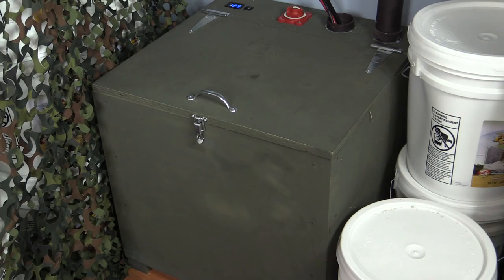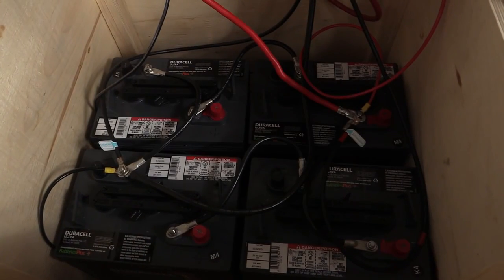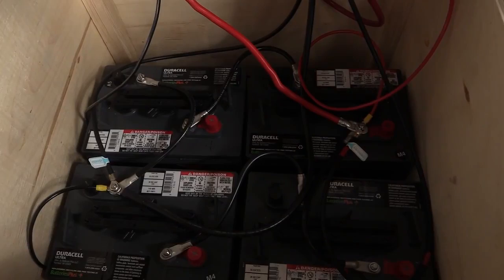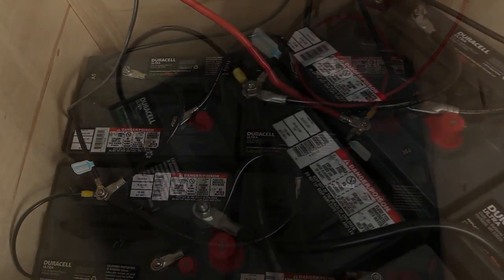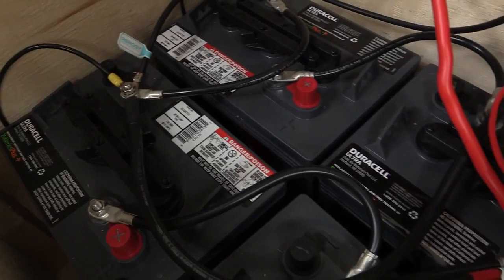The point of enclosing batteries is to avoid having all 5 kilowatt hours from discharging at once, in spectacular fashion. When working with batteries, we have lots of points of access to the power, or terminals, and we really want to avoid something shorting them or touching a positive and negative terminal at the same time.